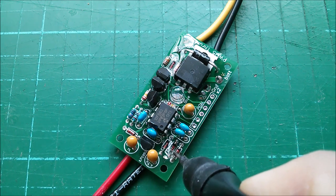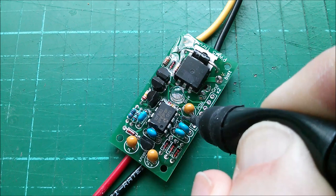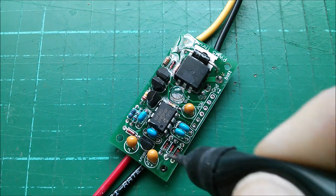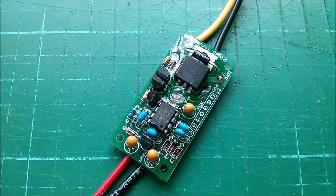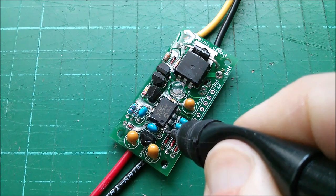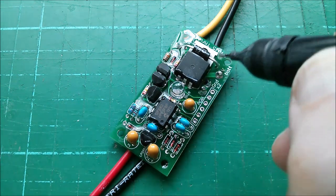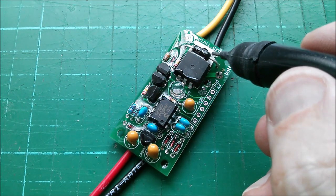Let's start getting in around the microcontroller and the LED, getting around all these legs. On the femto the little PWM5 required far less glue. I've only got these three tubes - am I going to run out doing this? Let's just carry on and see how far we get. Cover those three diodes that are part of the charge pump, then go over the programming header. I ought to get some UV on this now. Areas that will need additional glue built up are on top of the chip pins, because the chip's sitting quite high.